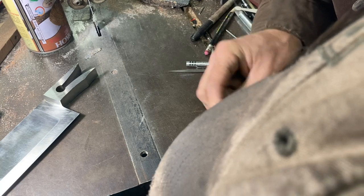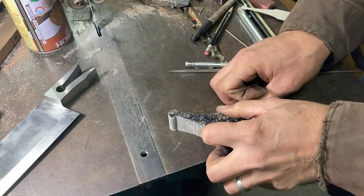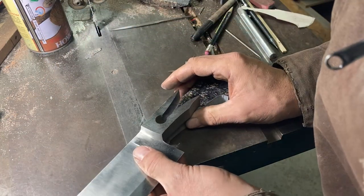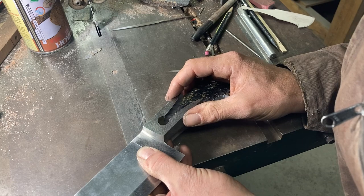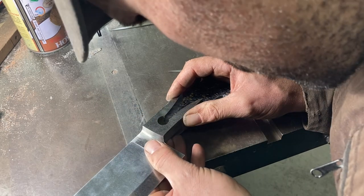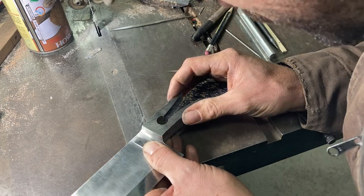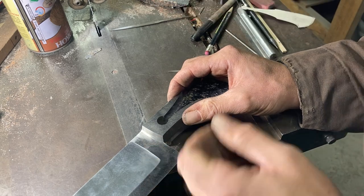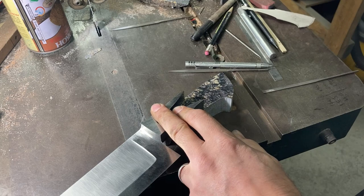This kind of stuff is too dicey to be doing with a grinder — it's so close to the line. From here on out it's pretty much hand work. You definitely want to get it all evenly, because if you don't, the areas that have been chamfered less will shove and bias the material towards the areas that are better chamfered, and you'll get a little bit of a crooked start on your material. Okay, let's have a look and see how that is — that seems fairly decent.